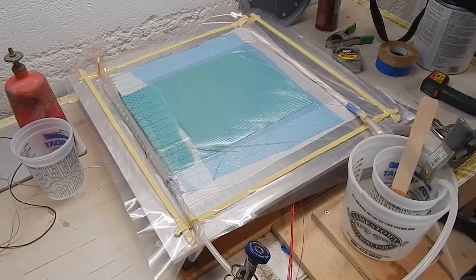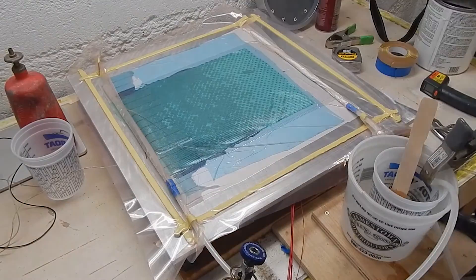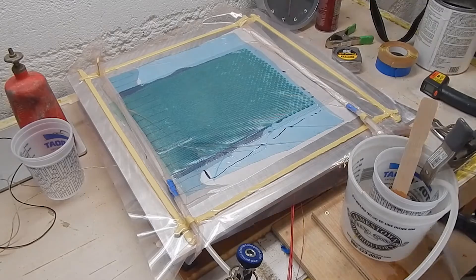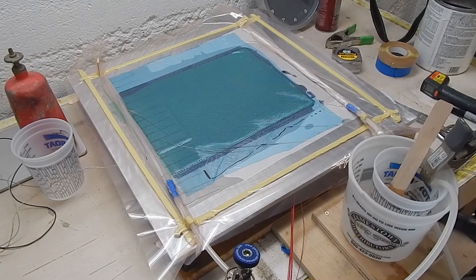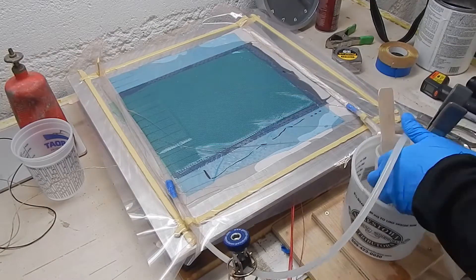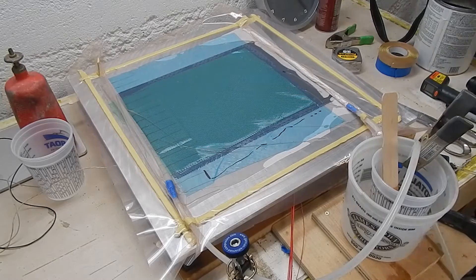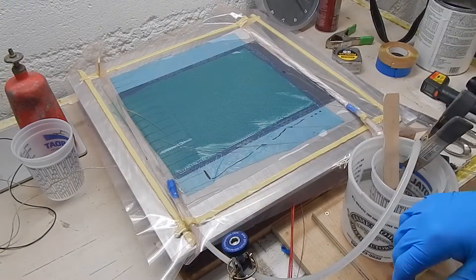This is one of the failures. Here I did basically the same thing except I made a stack right near the inlet side of probably six plies of material, and I used a perforated release film because I figured it's just a couple of layers — what could go wrong? I also ran the flow media almost all the way to the end, so there's not much resin break — just empty hose as my effective resin break. It didn't work very well. It appeared to infuse okay, but once I demolded it there was a lot of porosity on the bottom surface. I think a lot of air got trapped, especially where there was that six-ply-thick chunk — there was an awful lot of trapped air and ugliness.